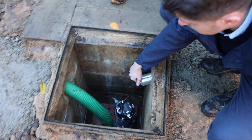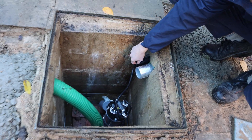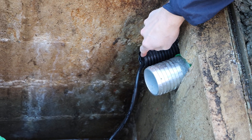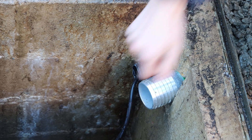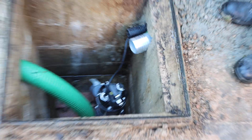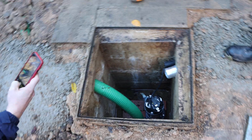So this is the water coming in, and actually conduit for your electric — you should always have a conduit because I've seen it where they've concreted the cable in. What happens in five years when the pump needs replacing? Presumably this won't be loose by the time you've bedded it. No, no.